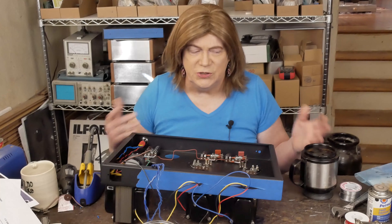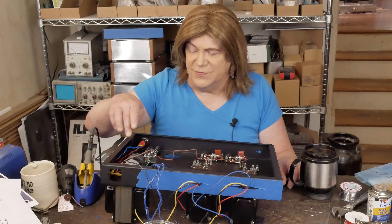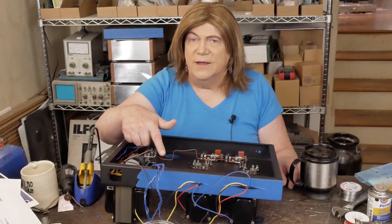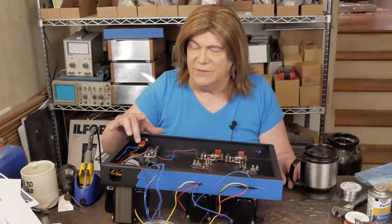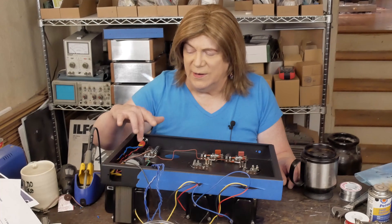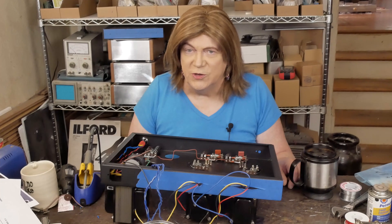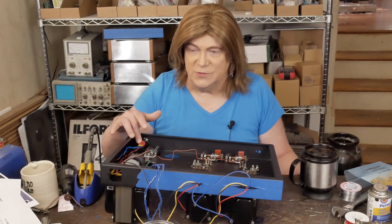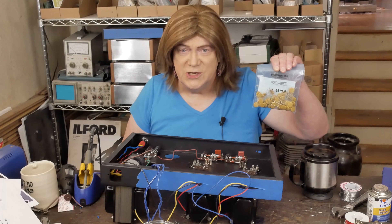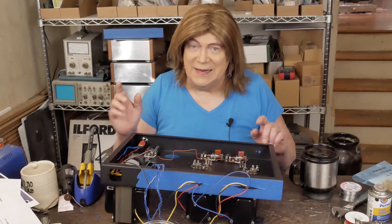Hey y'all! Today we're going to do a short segment on just this little section of the amplifier. You've seen me doing push-button switch wiring and wiring up the LED bridge rectifier, but I don't think I've ever showed y'all how I install this little capacitor. I used to wire these up direct to the terminals on the switch itself, soldering onto them and putting heat shrink tubing over it. I've changed it to use the little pigtail that comes with it so you can unplug and replace the switch. I'm going to show you how to install the little snubber capacitor across the switch that makes it quiet when you turn the amp off.